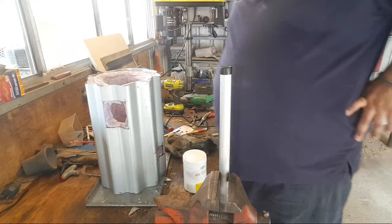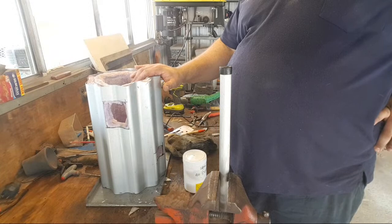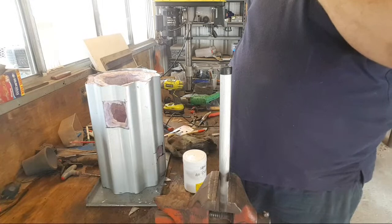So yeah, as I said, next stage is let this stuff dry, probably for 24 hours, probably a little bit more, because it's winter. And then while it's still moist-ish, I will apply a layer of Satanite. And then I'll let that dry for about 48 hours, and then I'll fire it. And I'll probably do the first lighting on a stream at some point too.